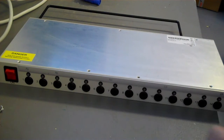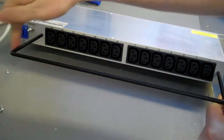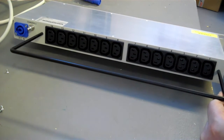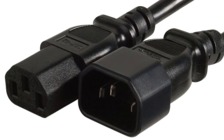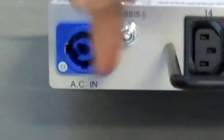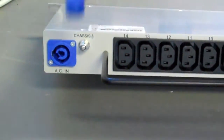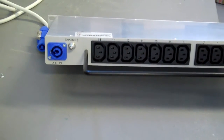Each circuit has an LED to indicate if the fuse is blown, so if this is at the top of a cabinet and you've got a piece of equipment that's out, you can see immediately which circuit is out. Around the back it's quite different from a regular power strip — there's a handy lacing bar so the engineer lacing cables into the cabinet can nicely dress the cables onto the bar so things don't get accidentally pulled out. You can see the 14 IEC outlets — these are 10-amp IEC C13 connectors as we call them in broadcast. The inlet is a detachable PowerCon, which is a 20-amp locking connector.